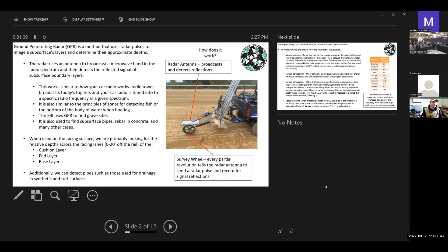The radar transmits a signal through the surface and we pick up on reflecting waves off these layers. This is similar to how your car radio works — the radio tower broadcasts a signal and you tune into a certain frequency, like 93.4 for example. It's also like sonar — for those who have gone fishing on a boat, you're sending a wave down through the water, it bounces off the fish and off the water floor and comes back up, so you can see your depth and where the fish are. A morbid fact: this is actually how the FBI can find grave sites — they use ground penetrating radar and are able to see where spots have been dug up. In the civil engineering world, they use it to locate pipes, find rebar in concrete, or inspect for internal fractures.